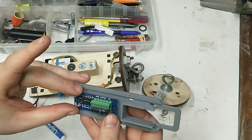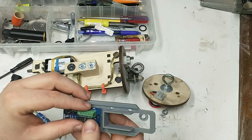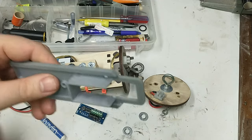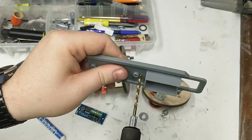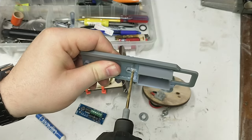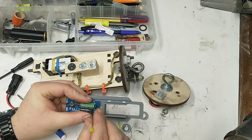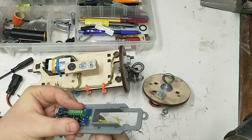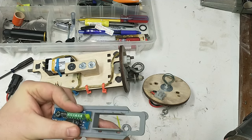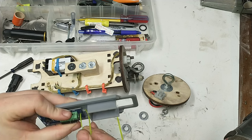This piece of plastic I'm mounting the altimeter to is a 3D-printed altimeter sled — that's just the term for whatever you mount your altimeter to, usually with the battery and sometimes a switch, and it slides in and out of the rocket. I'm drilling an extra hole in this sled so I can use zip ties instead of screws. I found this sled on Thingiverse, so thanks to whoever built it — I'll put a link in the description.